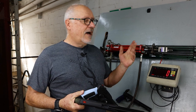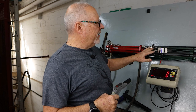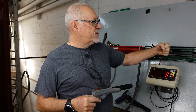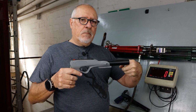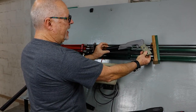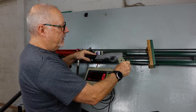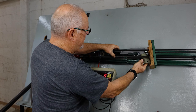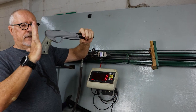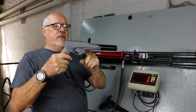I've pulled out an old scrap handle to test the jig setup first. Basically it's a ram pushing on a rubber ball inside the barrel. When set up it's slightly offset, which simulates you pulling on bands, and it's going to be thrust onto this rubberized piece of timber as hard as we can, simulating the load on the chest. We want to test this zone and this zone.